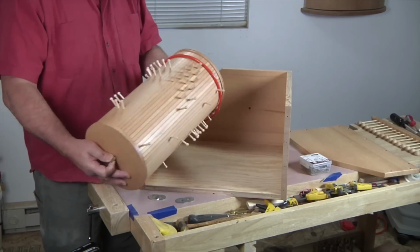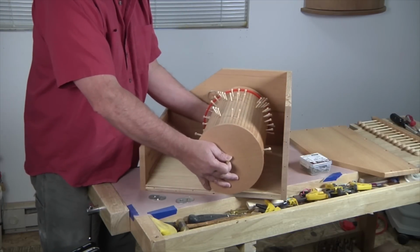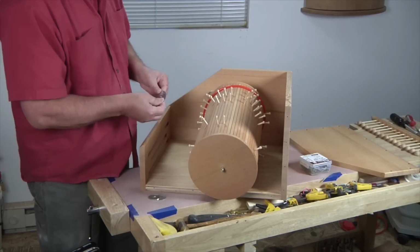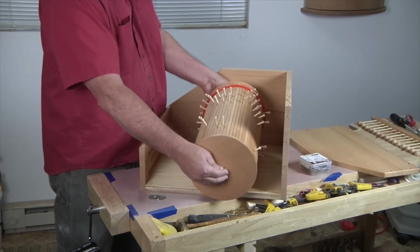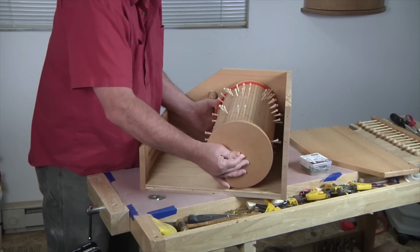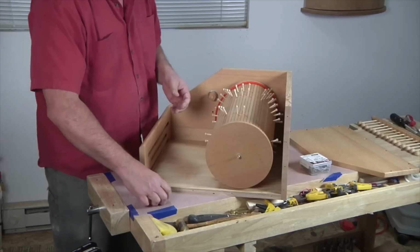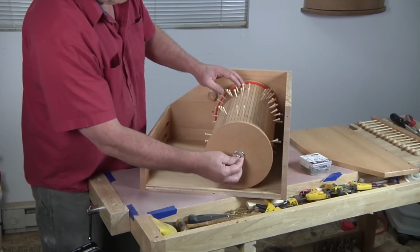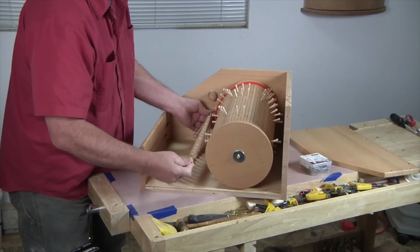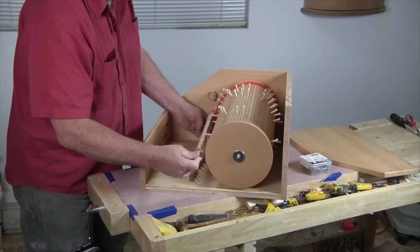Next, slip the round urethane drive belt over the left-hand end of the drum and set it in the case. Fit 2 3/8" fender washers onto the axle and insert the axle into its hole in the left-hand side of the case. After putting fender washers on the other end of the axle, set the music box's pivoting mallet assembly into place.